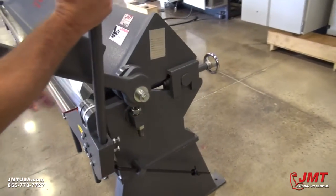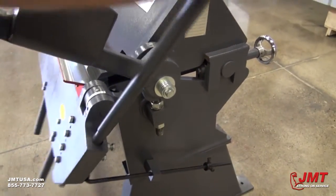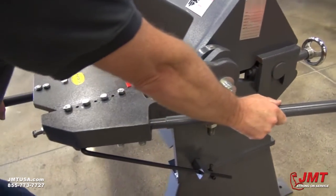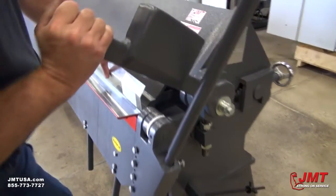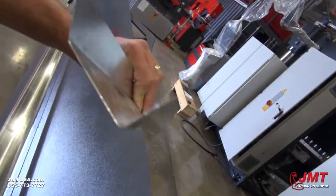So we can look at this and see there's probably close to a 90 degree, but because of spring back we might have to just go a little bit extra bend on it. We can lock it and see we have a nice bend right there.